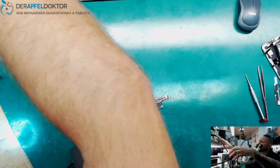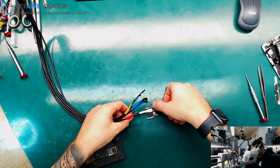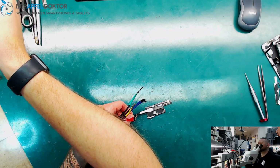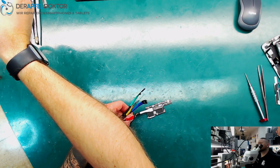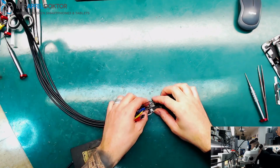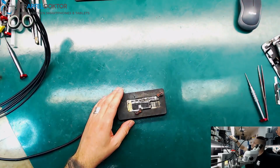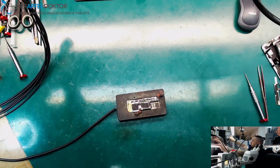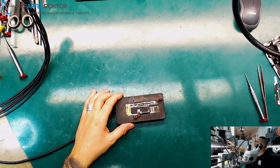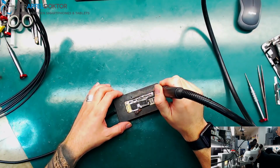At first I want to see for the value on power supply. So connecting that. And what I see is nothing, just struggling 100 milliamps, 50 milliamps, no boot. Okay. Then let's see what we can do in this case. What we can do in this case is just at first taking off the top layer board.